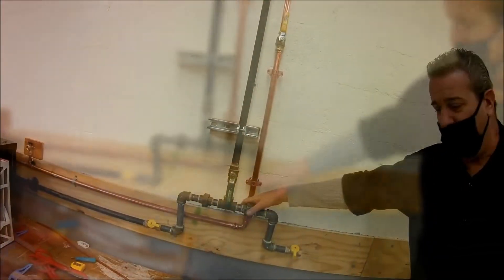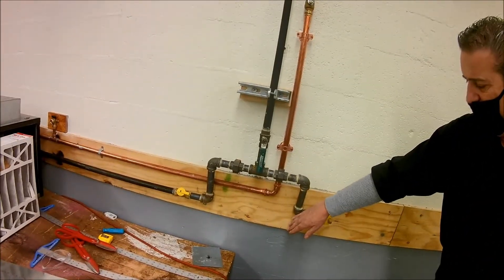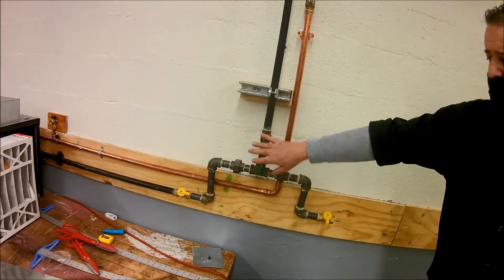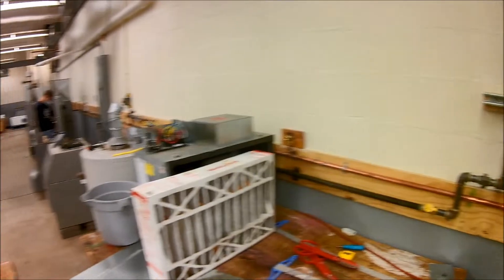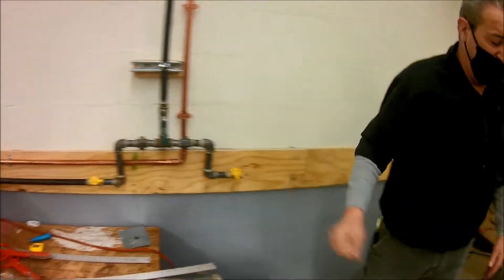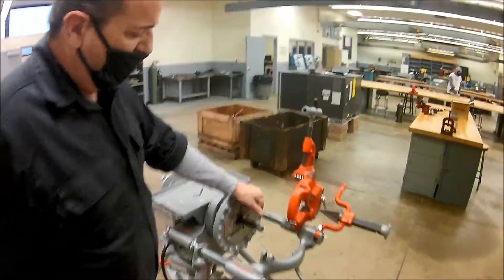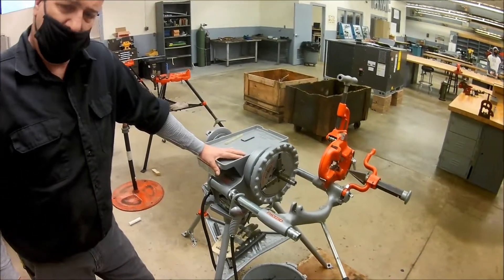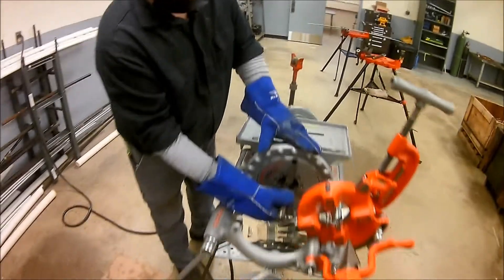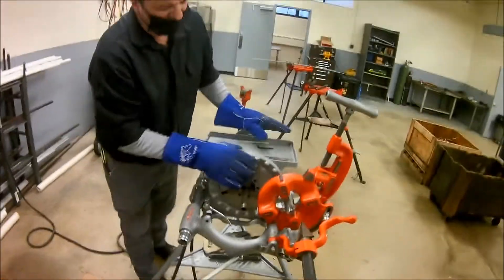You have the threads here and here. When you connect this all up, you have to be able to connect to it to get to your appliance. We have valves and fittings — here's a 90, this is a union, another valve. We've got to make sure we have everything sealed properly and the threads are cut in to deliver gas all the way down. The way they do that is with this power threader right here. We have a piece of pipe already in it that we threaded. I'm going to cut a piece to show you how we thread the end of the pipe — make sure it's centered, tighten it up, and pull my pipe cutter over and get it into position.